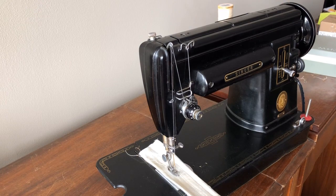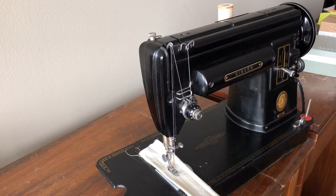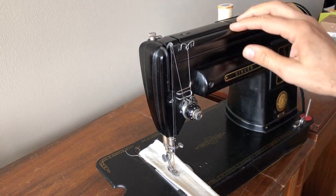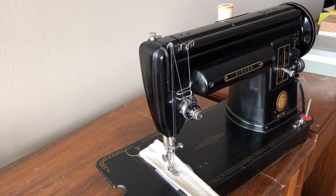The quality of the stitch, particularly on the 301, the Featherweight, and the 201 — all Singer rotary hook machines — produces some of the most beautiful stitches I've ever seen. Many people sew on machines with oscillating hooks, which also make wonderful stitches, but rotary hooks are particularly good at doing very short stitches on fabric. The Singer 301 was launched in 1951 to celebrate Singer's 100th anniversary and was state of the art. Like the Featherweight, it has all high-quality steel drivetrain and gears, but the chassis and body are aluminum, making it lightweight and truly portable.